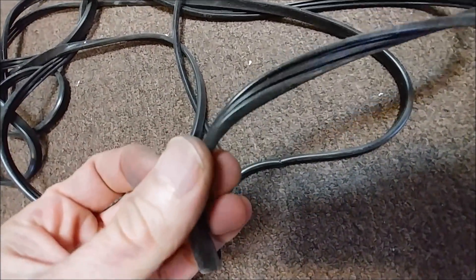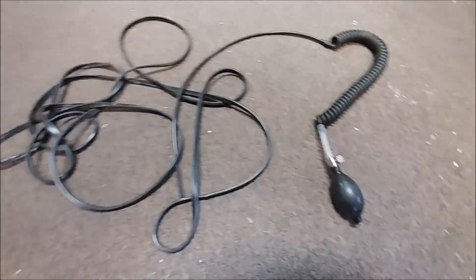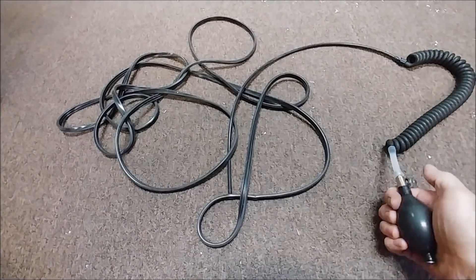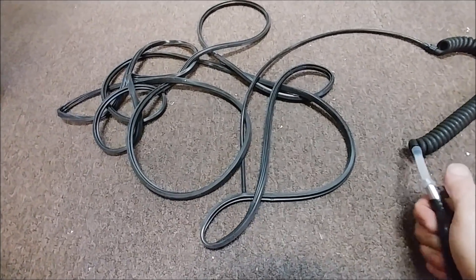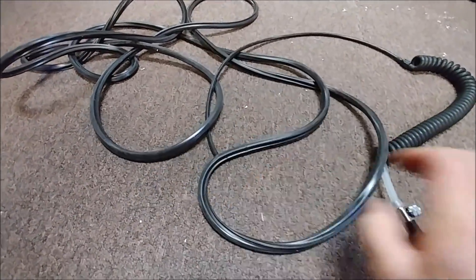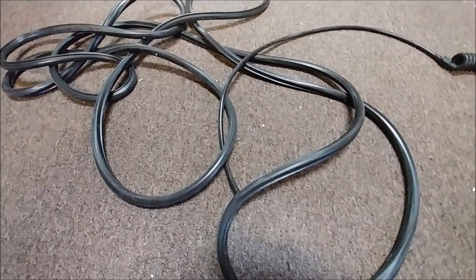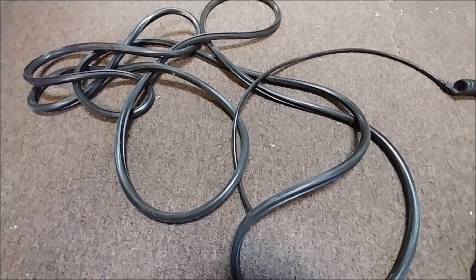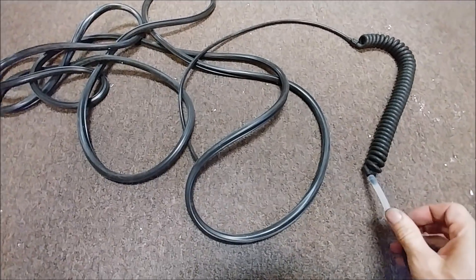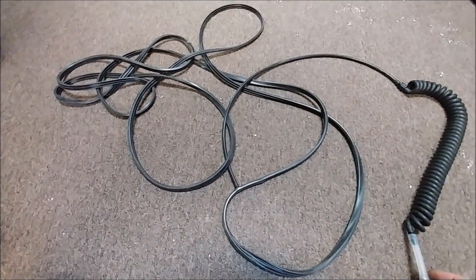Meanwhile there are the door seals — they arrived as a special order for the length. There's a tube that runs through the back, and I've got that hooked up to a regular blood pressure pump. You just pump it up and these things expand quite a lot. They're going to fit nicely in the door, and that's all it takes to basically seal it because you get 5 psi against them. One little area of about an inch long will probably only have about 3 pounds of pressure pushing on it, so it doesn't take much to seal the door because it's such a narrow gap. There it is deflated — those are ready to install.